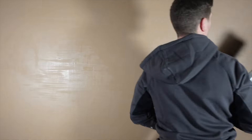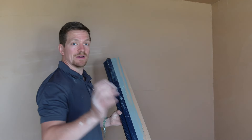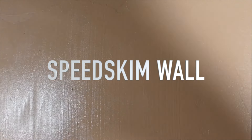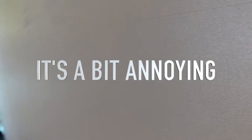I think the grills on the Speed Skim actually create more problems than what they're worth, because if you're not careful with the Speed Skim you can get tiger stripes. This one, being flat plastic, doesn't seem to be leaving that rippled effect on your walls that you can sometimes get with the Speed Skim — it's not doing that. I'll give it one more flat and then show you. These are the lines it's leaving, but that's hopefully going to go with time as the tooling wears in. You can see there are no ripples — it looks flat.